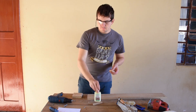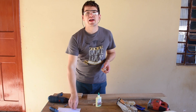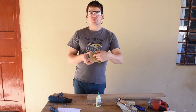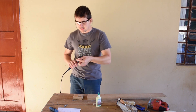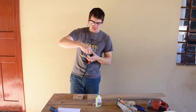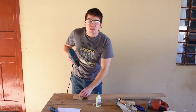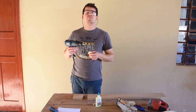For that, I'm using some glue and two small screws just in case — I'm using 3.5 by 20 millimeters. I drilled the holes through the plate and a little bit into the base. Now I'm going to use a countersink, because the head of the screws needs to be level with the plate. If you don't have a countersink, you can use just a bigger bit.